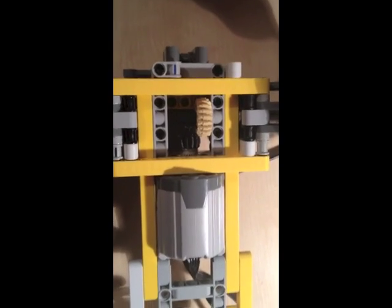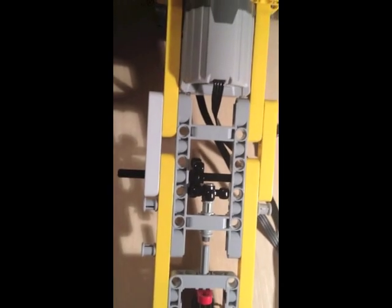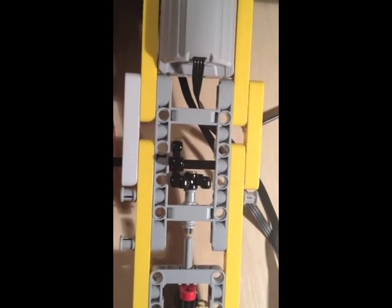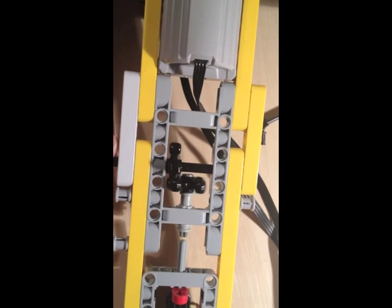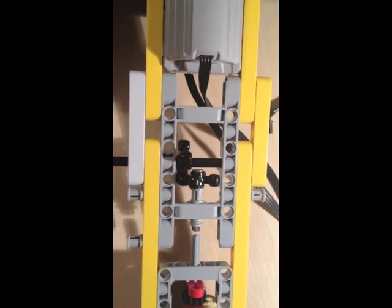An alternative is to use these type of tooth wheels. These tooth wheels can actually take a lot of torque, and that's pretty much the only reason for their existence. But they have one problem: they don't gear down. It's actually just a one-to-one relationship.